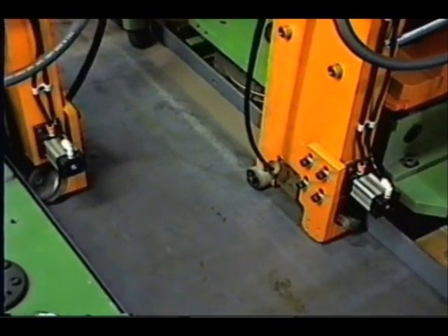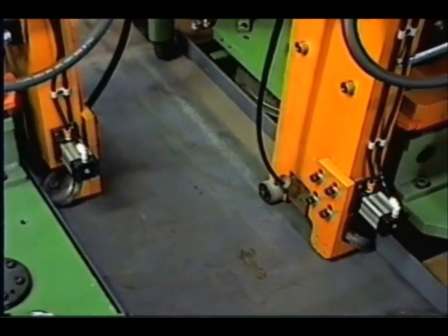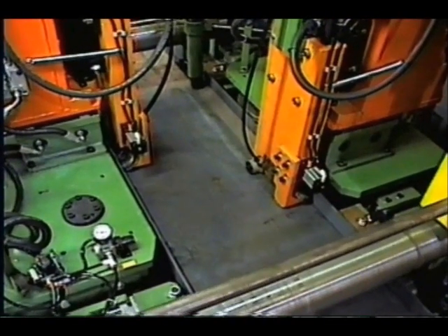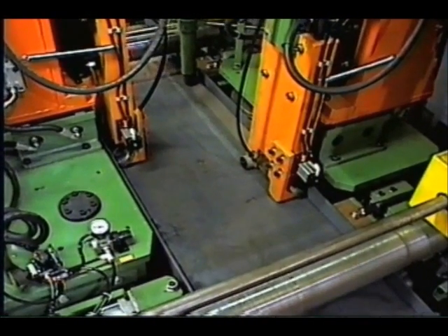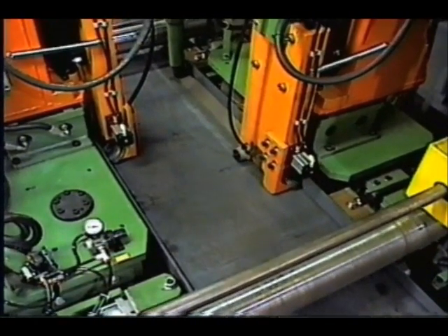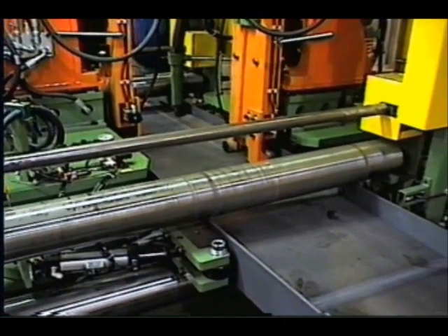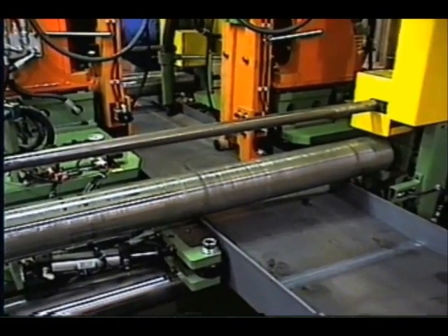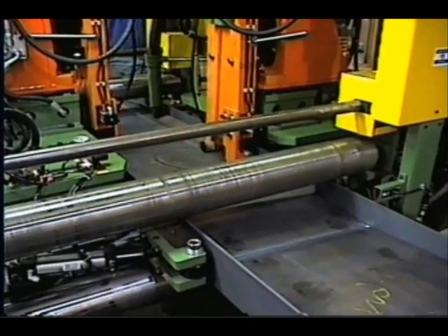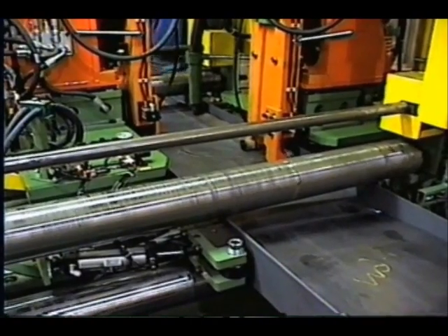The Franklin PTW-72 has two uniquely designed weld head assemblies. The weld heads are heavy one-piece aluminum construction to prevent magnetism. The solid copper one-piece 1000-amp contact assembly is vertically guided in the main weld head. The contact assembly supports two 1/16th inch or 5/64th inch wires, known as twin arc. The contact assembly has a solid one-piece tip that can be precisely adjusted in and out of the corner to provide the exact electrode stick-out required.